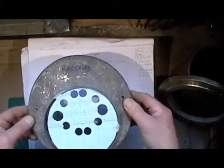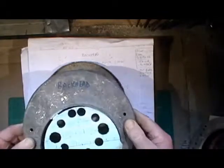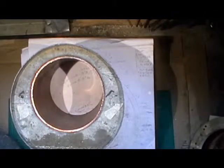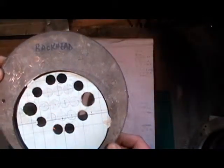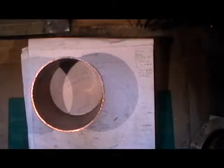Imagine that template is sitting at the bottom of this throat plate with an inner firebox in between it. The inner firebox will be there with the back head on, and then an outer tube round it, and then my barrel sits in this throat plate. There's an offset at the top for the throat plate and an offset at the bottom for the back head. That's a representation of where the tubes are going to run through the barrel - at the top of the inner firebox but at the bottom of the barrel.